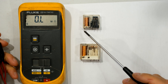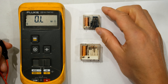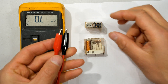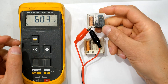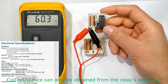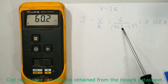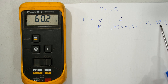The next thing to consider is how much current is required to drive your relay. You work that out by looking at the resistance between the terminals of the coil, and you'll also need to know the voltage of the relay. This is a 6 volt relay and I'll also do the same example with this 24 volt relay. Measuring the 6 volt relay with my meter — accounting for about 1.5 ohms of lead resistance — the coil reads 60.3 ohms. Using Ohm's Law, V = IR: 6 volts divided by the coil resistance (minus lead resistance) gives a current requirement of 0.102 amps to drive this relay.